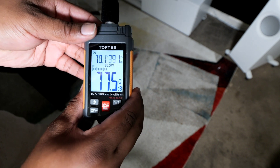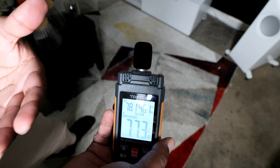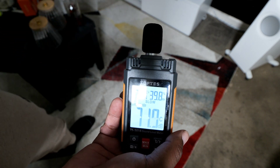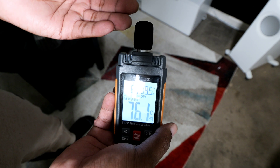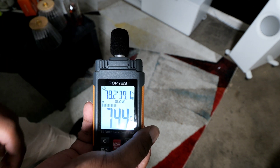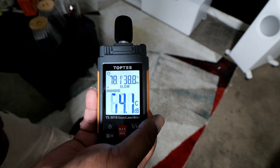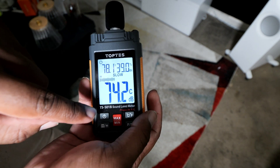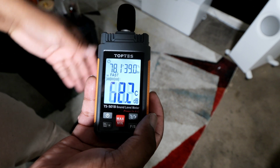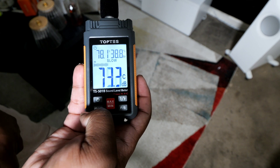This microphone should be really good for most people. It has a pretty broad frequency spectrum — detecting frequencies from 30 Hz all the way up to 8,000 Hz. It will be able to measure pink noise, which is what we'll use to measure speakers. It measures within half a second, so if you put it on fast it detects SPL changes within half a second, and you can slow it down for easier reading.